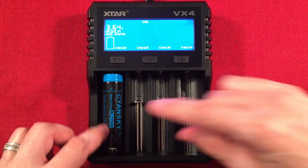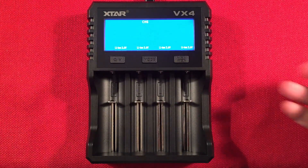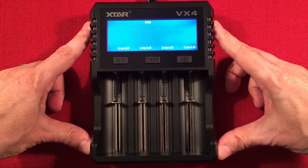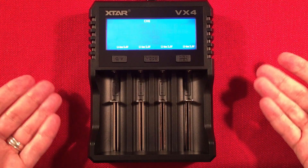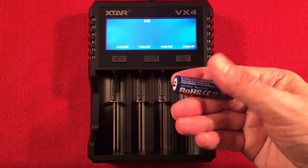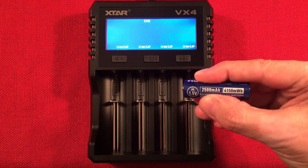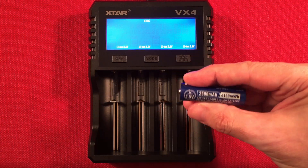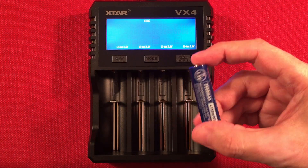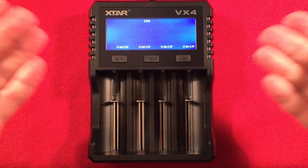For final thoughts: I like that this charger handles the large 21700 battery at various speeds — 3A down to low. Mixed charging is a great feature. Top positives: mixed charging, capacity measurement on 1.5V lithium batteries — useful for tracking cell degradation over time. These 1.5V lithium batteries are great for flashlights, by the way, though keep in mind they do emit RFI, so they're not ideal for radios.